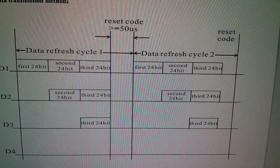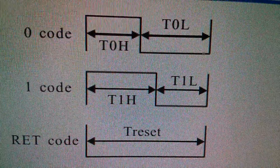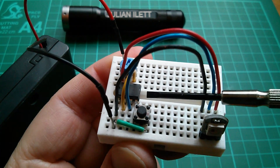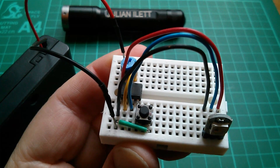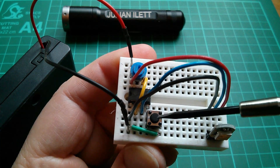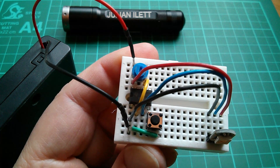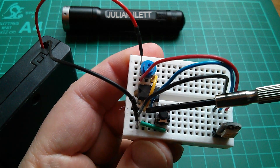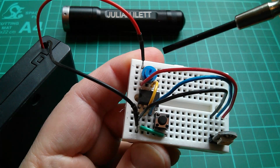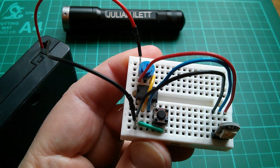I'm tempted to just shove a square wave at this thing — well, not quite a square wave, but that one-code waveform with a slightly longer high period than low period. So this is what I'm going to do: use a simple 555 timer. I've got pin 6 back to pin 2 so it runs as an astable multivibrator, a pot (I think it's 1k) going across pins 8, 7, and 6, and a switch on pin 4 which is reset. I've got no capacitor between pins 1 and 2 because 555s don't oscillate very fast, and I want this thing to go flat out — the few picofarads of parasitic capacitance between pins 1 and 2 will be good enough. I'll waggle the pot to find the precise point where the waveform is just right, then press the switch to give it several seconds of zero for the reset.